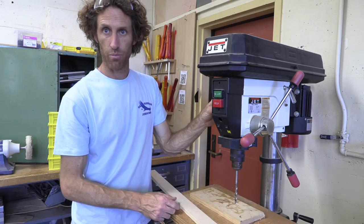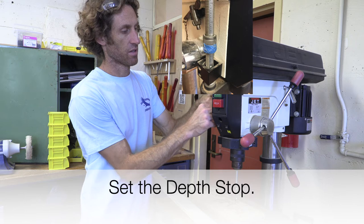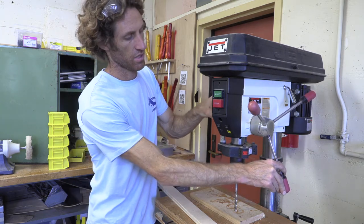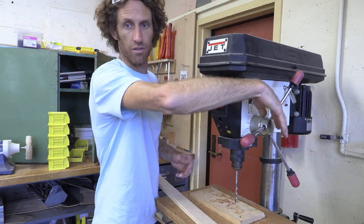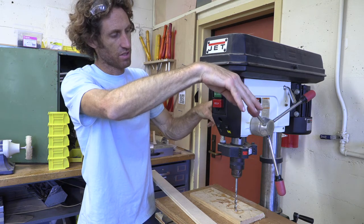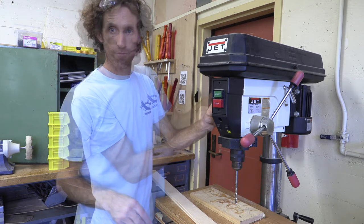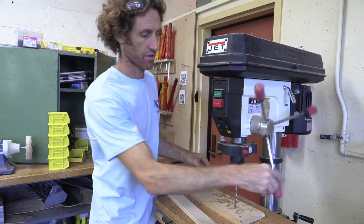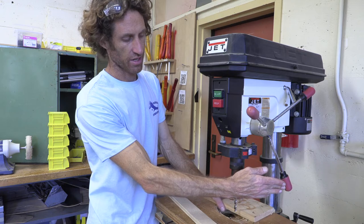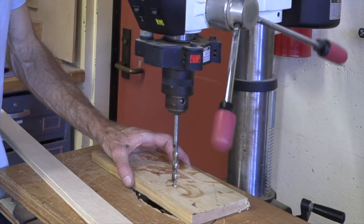What I want to do now is set my depth stop. I'm going to spin those nuts, then take the pilot feed lever and drop it until it hits the spoil board, then tighten those nuts up almost to the edge — leaving a little room — and tighten the two nuts against each other. That's going to keep them from moving. Now those nuts are tightened against each other, it's going to stop soon after it hits the spoil board. You can put the spoil board to the side and notice the bit is just barely touching — that means it's going to be a good hole.